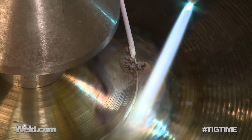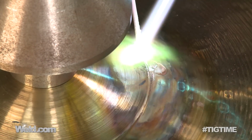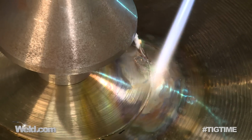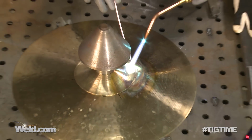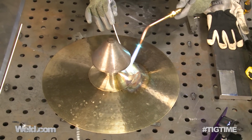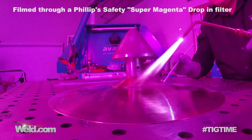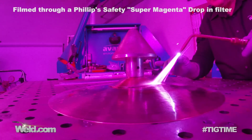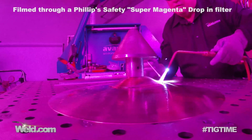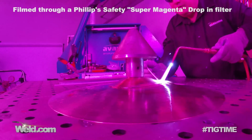let me continue on. If you've ever done plumbing or sweating pipes, it's kind of the same thing. It's just that I've got a little bit more gap in here. Yeah, so you've got a melting temperature of 1050 Fahrenheit. That's pretty high. Trying to keep from creating any red hot spots.